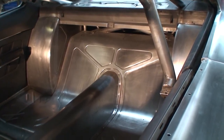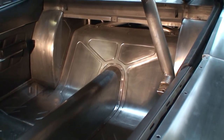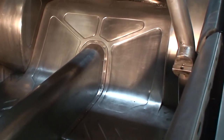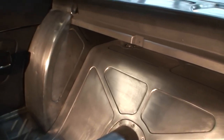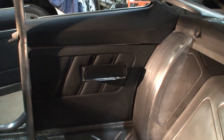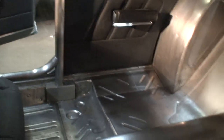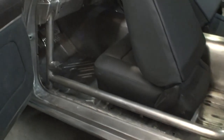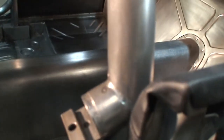Here's a view of the sheet metal work we did in the rear. We had to make new frame rails much higher, and we did a whole custom rear suspension. Here's all the bead roll work and the rivets, and the new tunnel we made — we kind of mimicked the factory straight presses there to make it look more uniform. Look at these monster tubs. Then there's some of the door panel work that Eric Thorson did for us. You can see how the cage is mounted into its own pad. On the cage we've got this low door bar, and even with that low door bar, we've got these removable door bars for the track that just clip in.